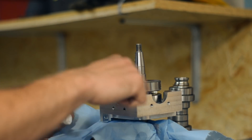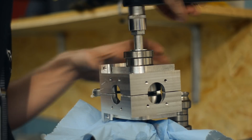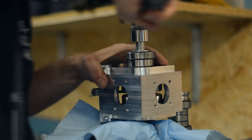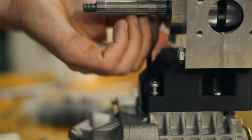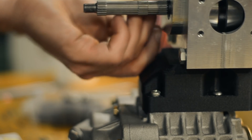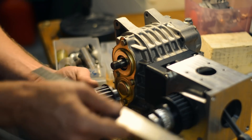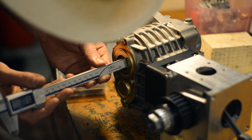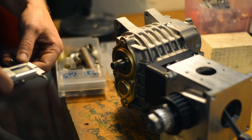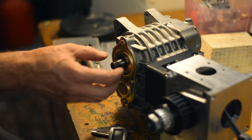Almost forgot — I need sealer, that was close. Now I'm going to set this here. It has to sit about 1mm off this plate. There's 2.8 millimeters from this surface to the seat in there, so about 3.8 to 4 millimeters total.